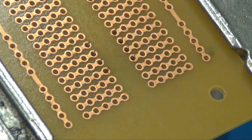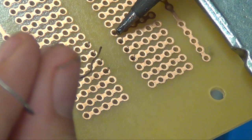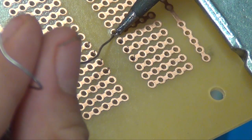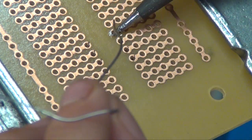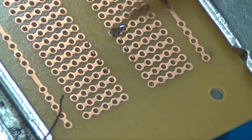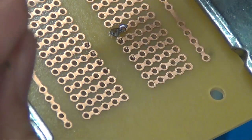I'm not good at holding the solder. Hold it there for two seconds and then apply your solder. Better clean your tip — your tip is dirty. Jab, jab, jab and try again. Just hold it up tight against it. There you go, that's good. Just go on to the next one.